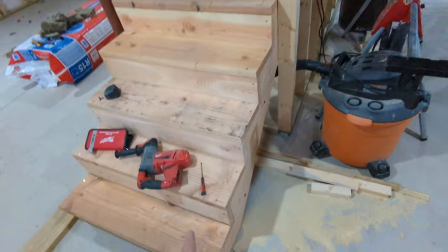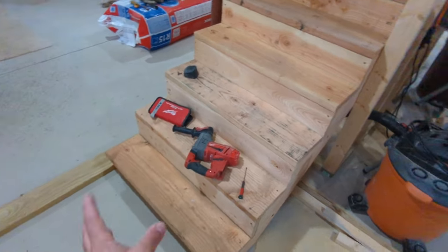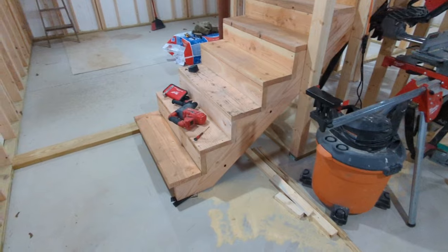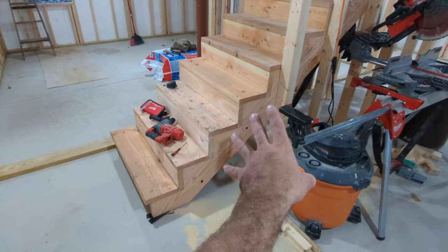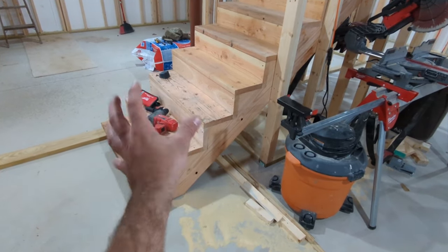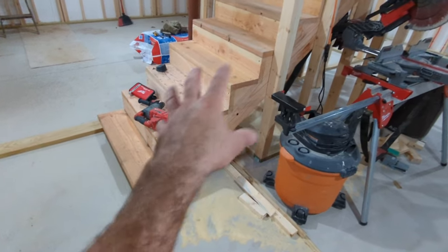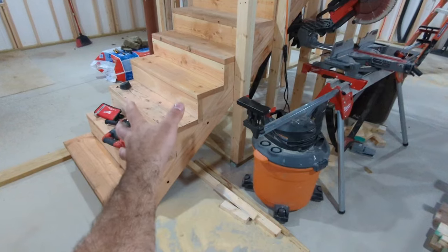We're not going to flip the surface of the stairs up as of right now. I ran that by Ed, and he seemed to think it was going to be... I tried telling him, I'm not going to charge you. I just want to see a usable space here. He didn't like that, so we buttoned it up for now. I can always come in now that it's screwed tight, and glue wood triangles into the underside of it that will set up and force it to occupy this exact space. Then later, these screws could be zipped out, and hopefully it would sit perfectly like a glove and fit those stringers without rocking around at all.